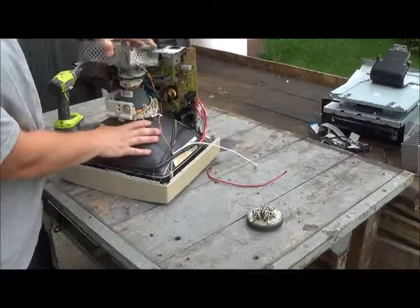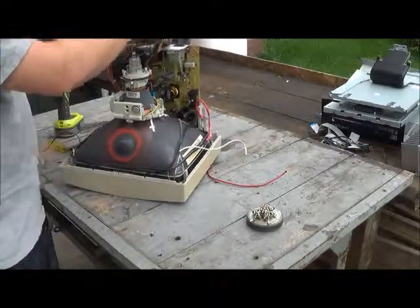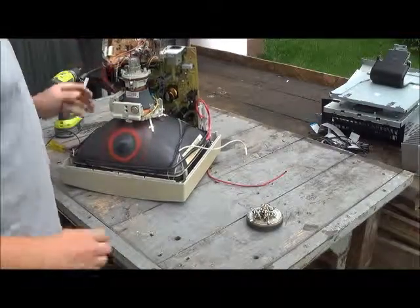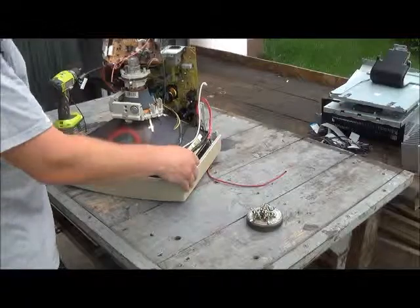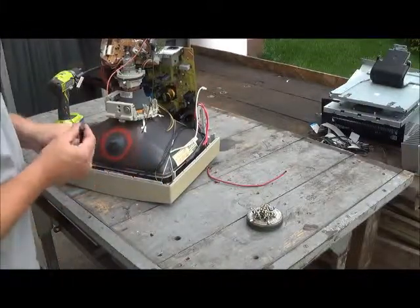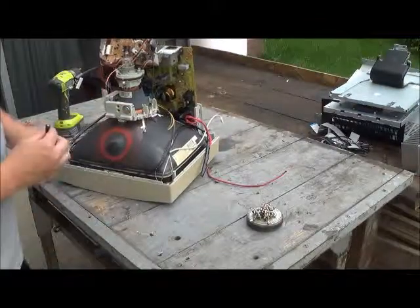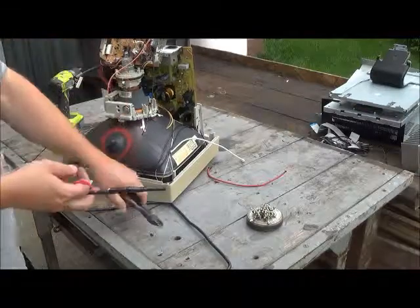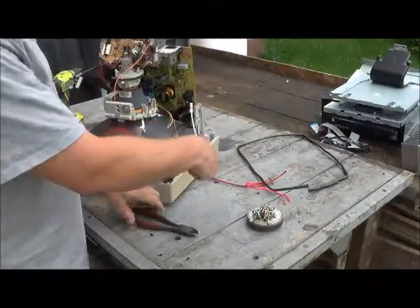These are kind of tough to get off sometimes. You can see there's a decent amount of wire in there, and this yoke has a little tamper-proof bit so I have to go back inside. One thing you want to check is that this wire is actually copper — a lot of times these are aluminum, but this one is copper. The weight will tell you. And also if you see a little silvery stuff in there, that means it's aluminum. But this one's copper. These are really easy to strip and worth your time because it's mainly copper and less insulation.